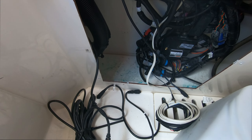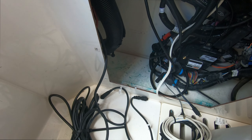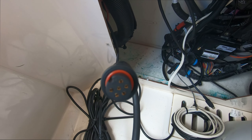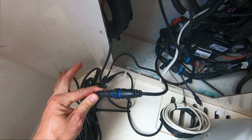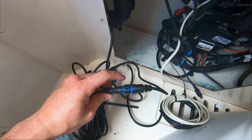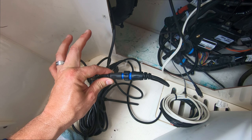I've already taken out the old GSD 22 box. This is the transducer cable — as we can see, that is a six-pin right there — but if we follow that pigtail back, lo and behold, there's an adapter. This is the original transducer cable and this is the adapter on this side. We just have to unhook this connection, and then this is going to plug directly into the GSD 24.